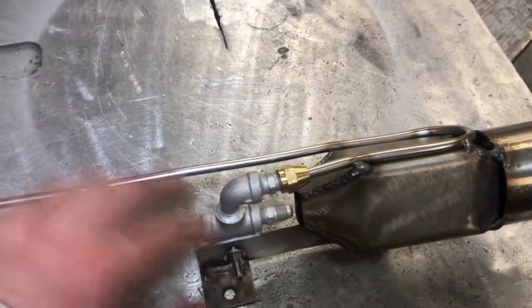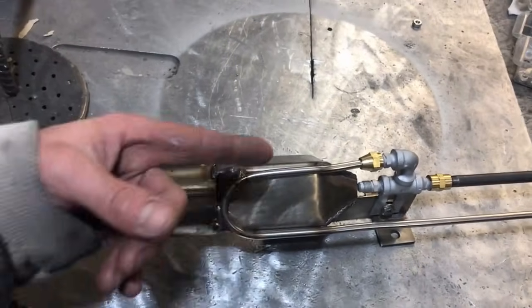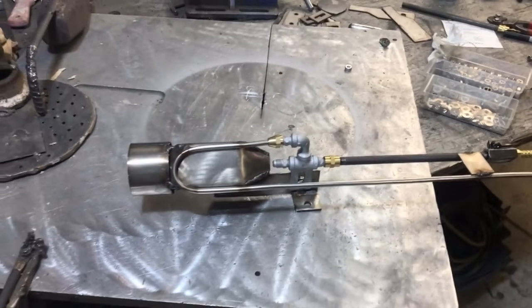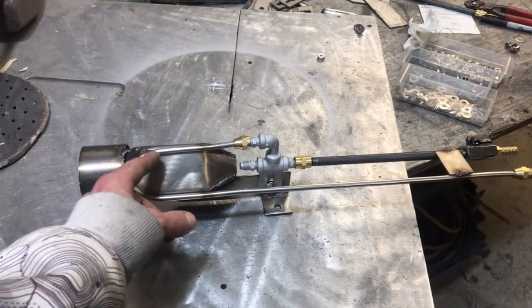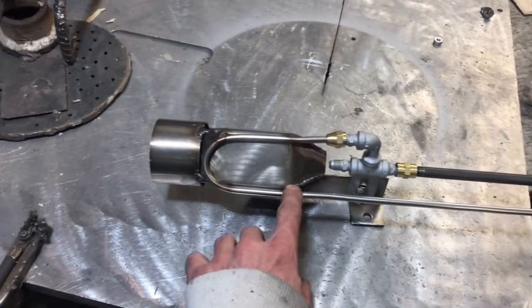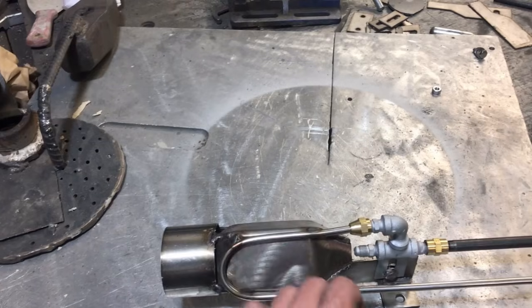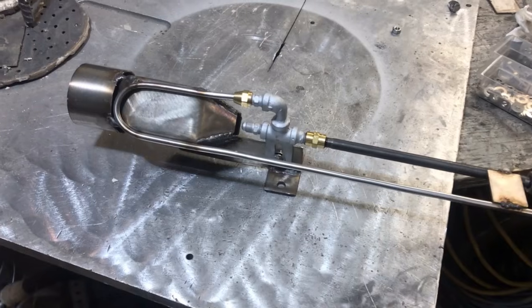The air input on this device is what heats up the fuel and everything else. A lot of people are always telling me why aren't you running the fuel through that, or telling me to wrap a coil of fuel around the burner. Been there, done that. I have videos on it where I actually take the coil apart after just several hours of operation to observe varnish buildup inside the coil that reduces the efficiency drastically — it's a cascade effect to the point where it just no longer works and clogs up.